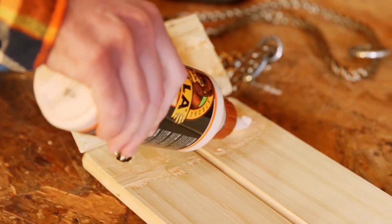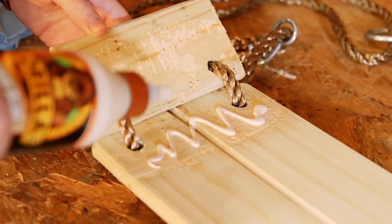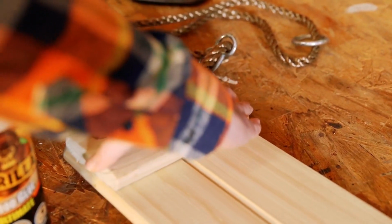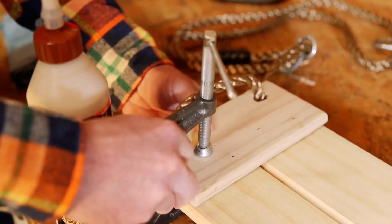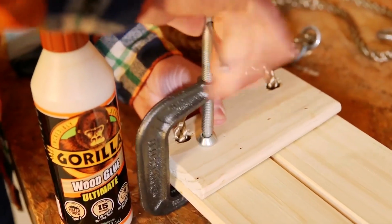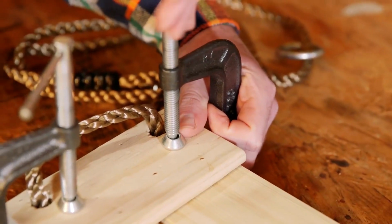Be sure to line up the grain of the two pieces of wood and apply the glue generously to one surface. Join the two pieces together and move into the desired position. Last, clamp for at least 20 to 30 minutes. The wood should fit tightly together with no gaps. This ensures a strong and continuous bond.